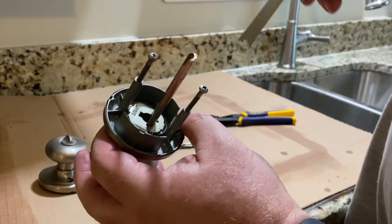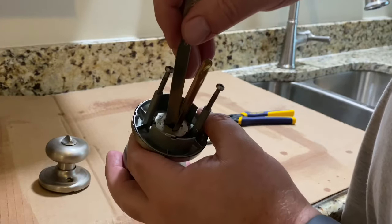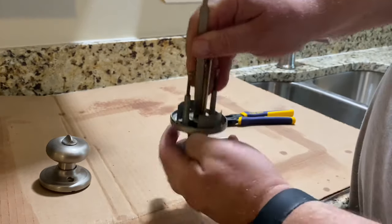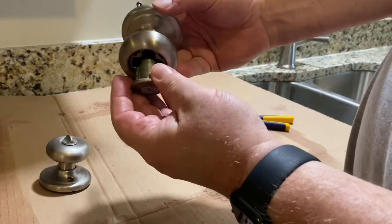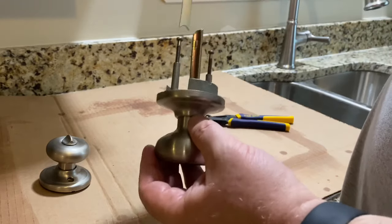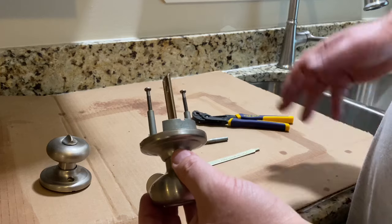Once you've done that, use the other end of the tool — the little double-tip end — and work it into this hole where the little cylinder rod came out. That will push on the top and the bottom. Tap it and the cylinder comes right out. It took me a few tries the first time, but once you have it, it's a piece of cake. This tool is the lifesaver — buy this tool. Trying to do it with screwdrivers is so much harder, and you won't damage the lock.